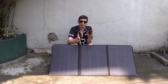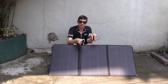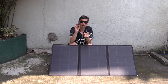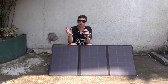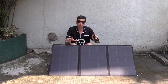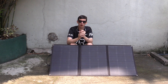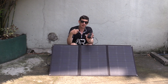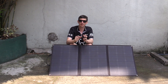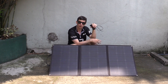Let's say you're going hiking — you can't carry huge lead-acid batteries, it would be too heavy. You can still use something like this: carry a number of these little USB car adapters and then everyone in your group would be able to charge a cell phone or charge their power banks. By charging power banks you're actually storing the power for use later. This could be used as a fully portable system, and for emergency purposes like helping typhoon victims, I'd buy a bunch of 24-volt USB car adapters and just let everyone charge their cell phones.